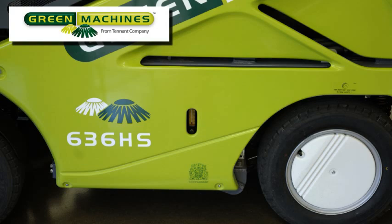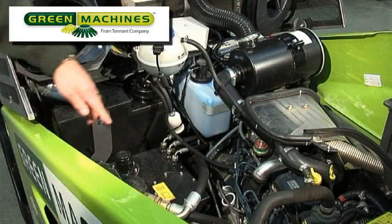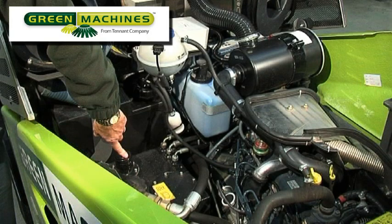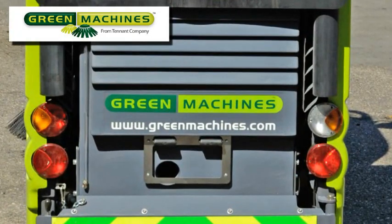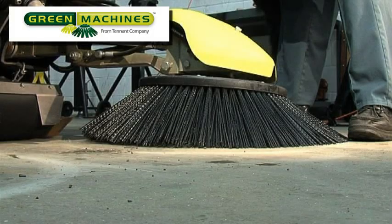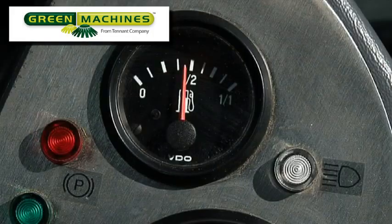Next, check the hydraulic fluid level in the tank sight glass on the left-hand side of the machine. The hydraulic fluid level should be at the top of, or very near the top of, the sight glass. Make sure the oil is a distinctive brown-amber color and that the oil is clear and bright. If the oil looks cloudy or milky, report that service is required. If the hydraulic fluid level is low, fill the tank to the correct level using the correct oil. The hydraulic fluid is the same oil as used in the engine; the correct specification can be found in the operator's manual. Make sure the dust suppression water tank is full — the water level can be seen at the rear of the machine via the sight glass. Confirm that the brushes are in good condition and the brush angles are set correctly. The fuel level should be checked by turning the ignition switch to the on position and observing the fuel level gauge.